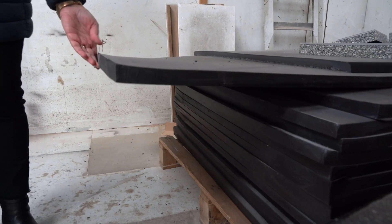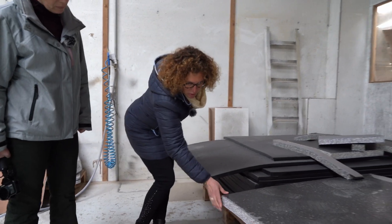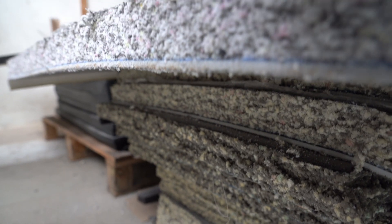There's a black foam, so we put the cork plus this foam. You've got five millimetres of cork and then two and a half centimetres of foam on top. This is the insulation for the engine room — for the soundproofing. Nice and thick. That's the difference between this and production boats.